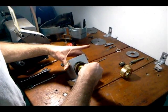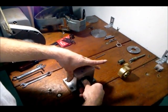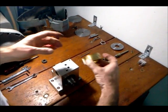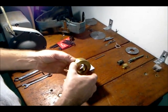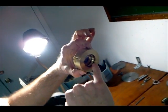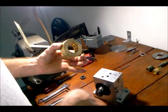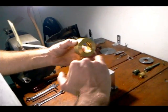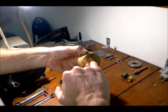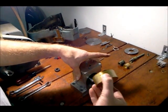The first thing I'll do is put the worm wheel in and get it in place. I made a bushing here — I actually cut little rings for the grease so when I pump grease into the grease fitting that I installed on the back, it fills these rings and goes across, so it has plenty of lubrication while it's working.